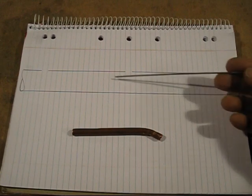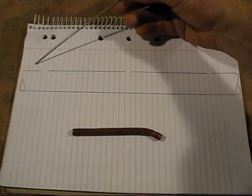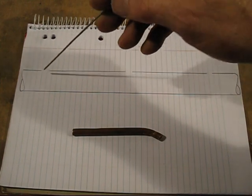So what we've got here is a forced air propane burner. Big difference from the previous burner I showed you. This is the propane pipe where it goes into the burner, and this is just a drawing, a representation of the burner. It's just a straight pipe. There's nothing in between, no venturis, nothing. I'm going to put that propane pipe in here, then in here, then in here, and we'll see that it makes no difference where the propane enters the pipe.